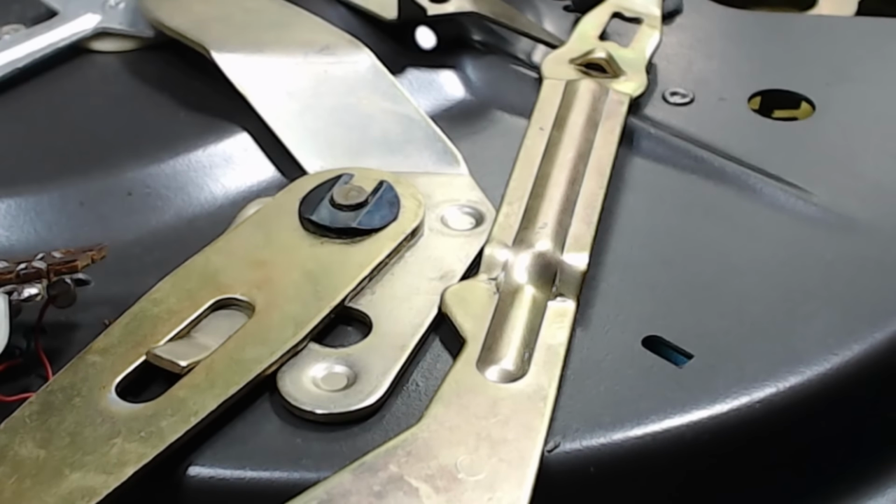There's a little pad in there, a little white thing. I will top that up with as much oil as that'll take. So I'll just keep adding it till it starts running out. And there's another pad there. Do the same with that. It's not taking any more oil on. It's starting to run out. So I'll let it soak for a while, and then I'll go in and just make sure I get all the excess oil out, and I'll put it back on the turntable.